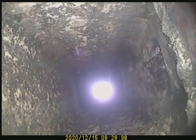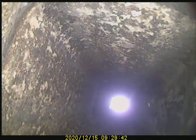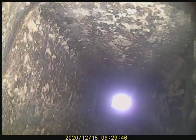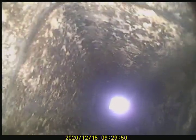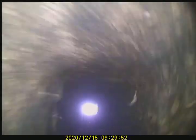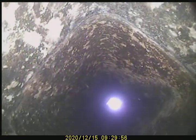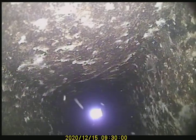This does transfer into a 7x7 flue. About two courses of flue tile up was the transition point. So we have a 7x11 at the top and a 7x7 currently. Again, a lot more deterioration is present.